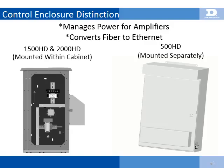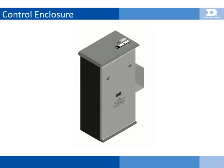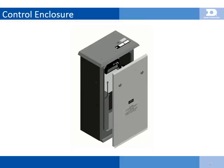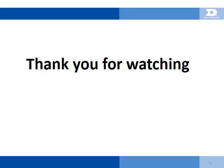The control enclosure in the 1500HD and 2000HD systems slightly differs from the control enclosure in the 500HD sound system. First, the control enclosure in the 1500HD is smaller in size, so it is housed within the cabinet itself. Second, the 1500HD control enclosure contains only power and signal connection points, whereas the 500HD control enclosure contains amplifiers as well. The control enclosure is accessed via the rear access door located on the far right as viewed from the rear of the speaker cabinet. Accessing components is as easy as a quarter turn of both latches, done with either a flathead screwdriver or coin. The control enclosure is partitioned for low-voltage signal components, the fiber-conversion network switch, and audio isolation transformer, with a separated compartment for high-voltage connections and power supply.